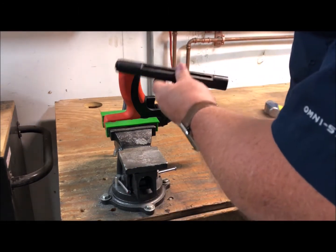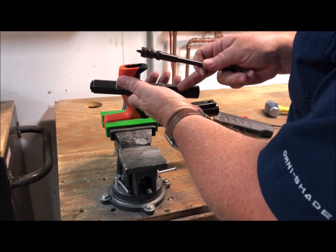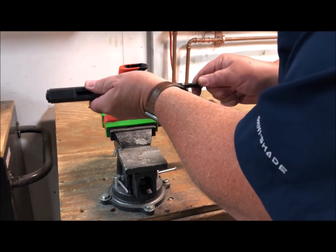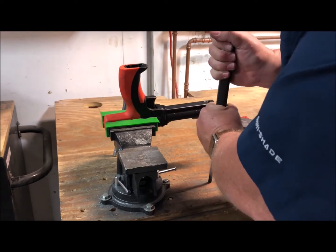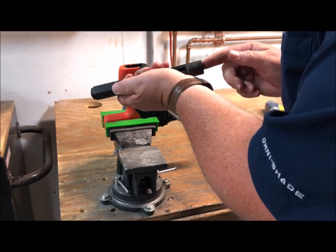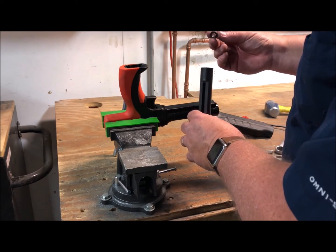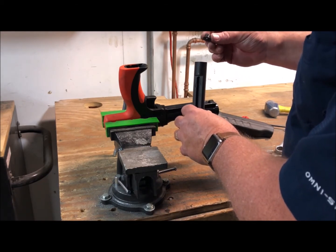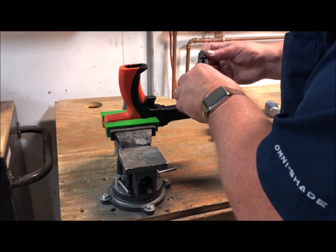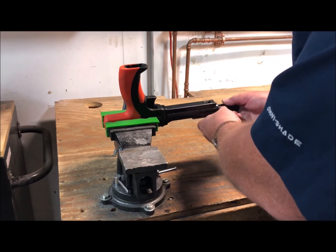Let's reassemble our tool. We've got our barrel and our piston. You'll note there's a gap in the piston ring — we're going to put that away from the slot where the return dog rides; it seals up the ring a little better. Work that in there and you might need the hammer. Push it all the way back in with your finger. Now drop in the buffer — some guys call it a smash ring, it looks like a top hat — put it on like a top hat and get it on the piston and it'll slide on there.